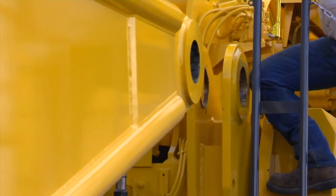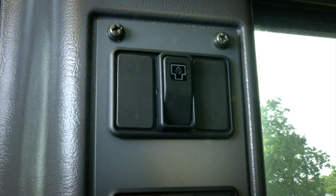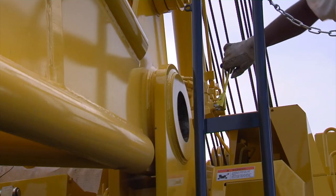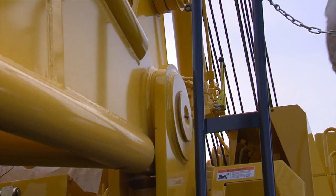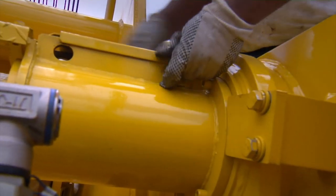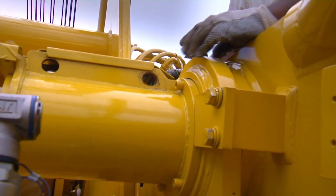Lift the boom base and travel forward as needed to align with the boom foot pins. Set the three-way switch inside the cab to the boom foot pin and move the hydraulic control lever to the extend position and install both boom foot pins. Install the locking pins and keeper pins. Install the shims as needed to take away any excess side play.